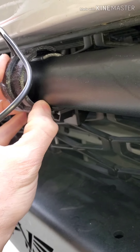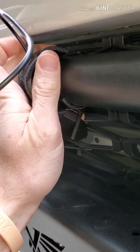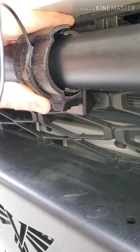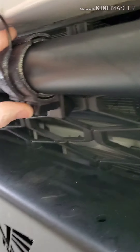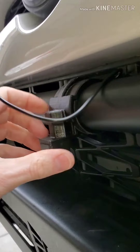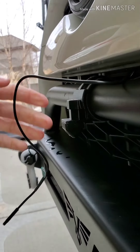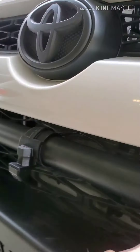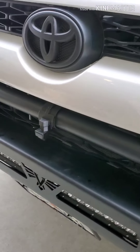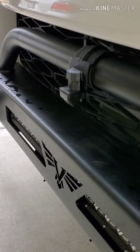I know I can slide over from the side, but that's why it's important that you use a filament that has flex. This is PETG as opposed to PLA, which would most likely fracture. There we go — it's not turning, it's rock solid. Let's get it nice and centered. I'll thread the cable back up in there. If you just look at it from here, I don't think it's going to jump out at anyone as what it is — not a whole lot of inclination to mess with it. And if I want to tighten it, I can zip tie it. I can always pop it off if I ever need to as well.